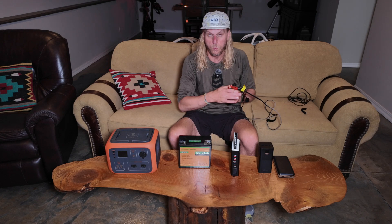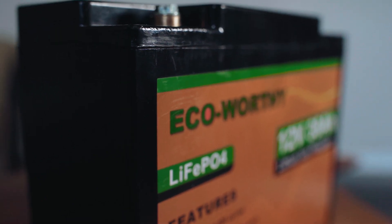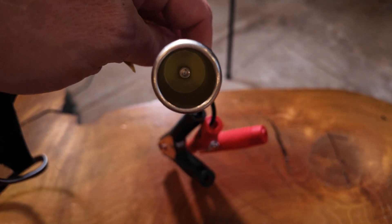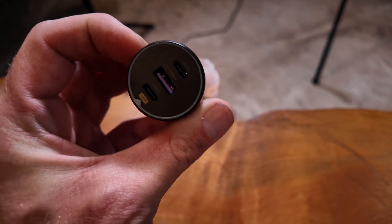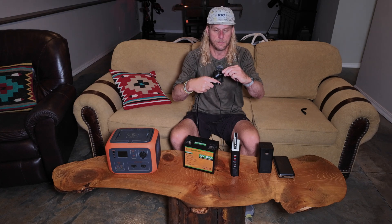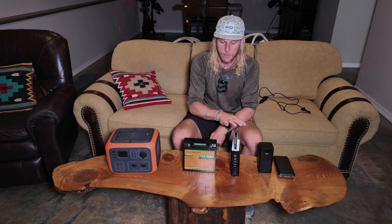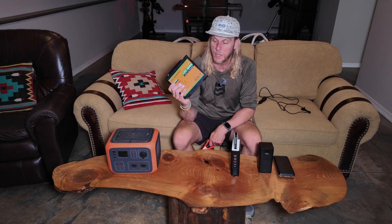For the raw lithium battery, you'll also need a cord with gator clips — positive and negative — that outputs as a cigarette lighter adapter. Then you need a male cigarette adapter to USB-C, again rated for at least 100 watts. Put that in, then take the USB-C to barrel cord and plug it in. That seems like a lot, but what you're getting is protection from over-surging and some versatility. These raw batteries are a bit more expensive but offer good value, and these knockoff brands tend to come from the same factories as name brands.